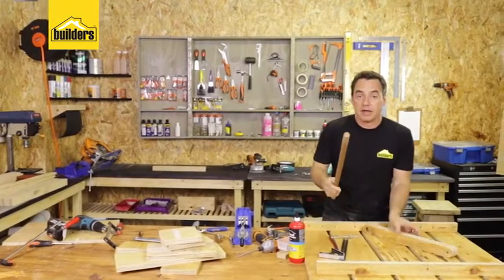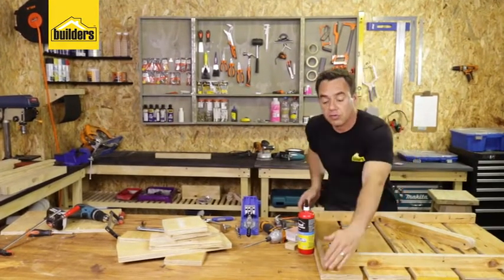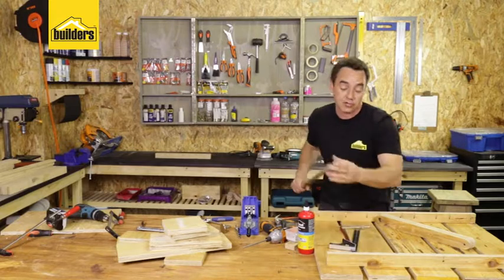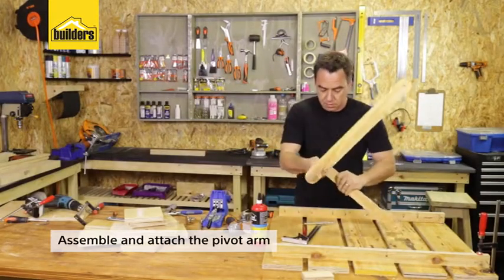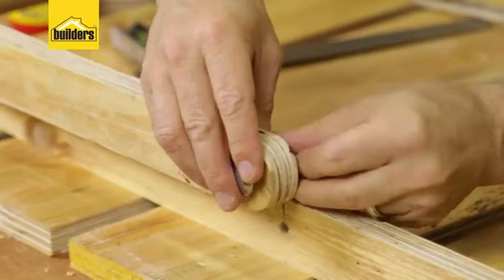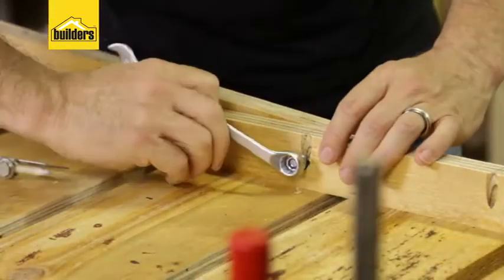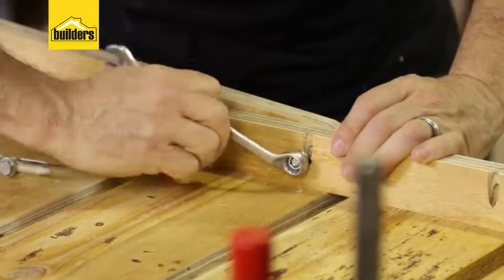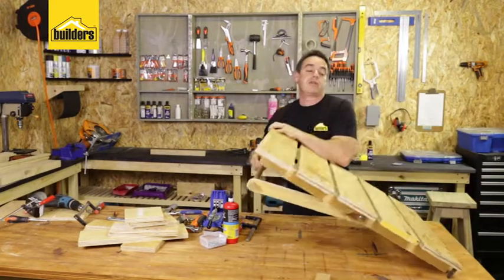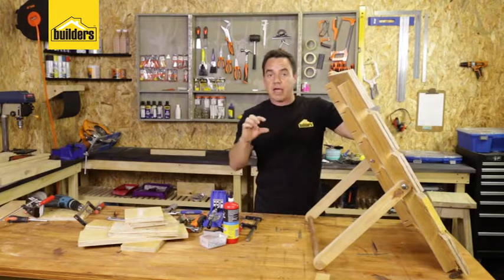We've got our two pieces. I've cut my dowel stick to go a little bit on the inside of the box — I measured it as 700mm minus two thicknesses plus a little clearance, with an extra 5mm on either side so it doesn't catch on the box frame. You're going to put the dowel stick all the way through, and that's going to sit on the outside edge of the box frame. I'm bolting it into position using cup squares — these push into the timber and lock on one side, and I like them because they have a more attractive head than a normal hex bolt. That's going to pivot so our swing arm goes up and down and locates into the box and into the ratchet rack.